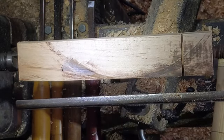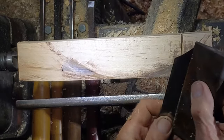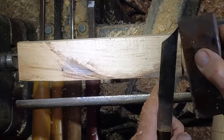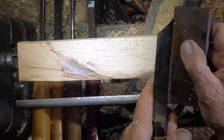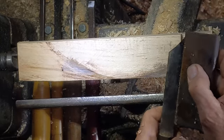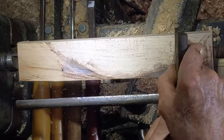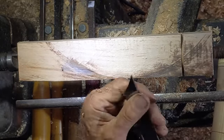Occasionally I'll take a slipstone that has a rounded top, and I'll polish that flute a little bit. You have to be very careful that you don't raise this thing up and grind a new bevel on the end. You want to keep it very flat and just polish that thing. And I actually put it down like this, so I can put some pressure on it. So this is just a little India stone, and allows you to polish that thing.